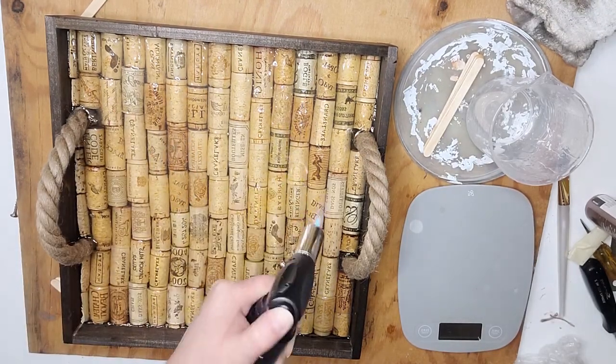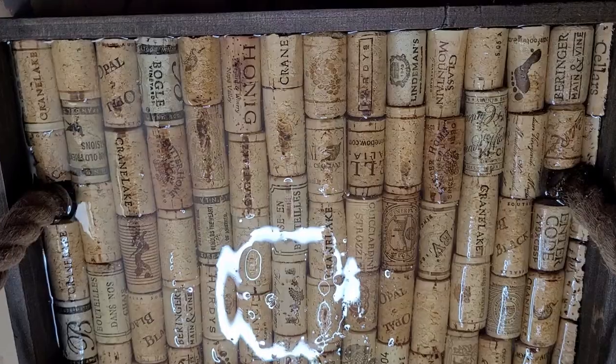I kept coming back with my torch every 10 to 15 minutes to pop the bubbles so they wouldn't ruin the final finish. There are still some bubbles but they don't look too bad. One warning: be very careful with the torch because the extra heat speeds up the setting process, and if you torch it too much you'll get a weird film buildup on the top of the resin. That did start happening to me, but I knew to look for it, so I stopped immediately and just let it go.